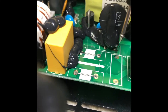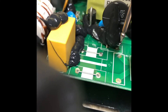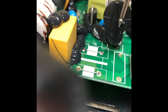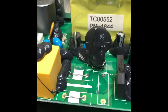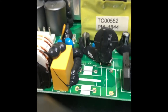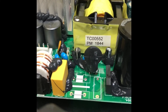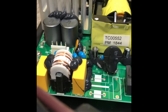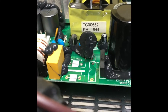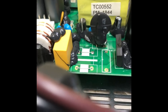It has two legs that go through it — one here and one here — and they're so skinny that the thing has room to bend and flop. You can see where I put a glob of solder to join the leg back together; it was fractured. So the amp would cut out after it had been on for a little bit — it would just suddenly stop. It took me forever to find this, but hopefully if anybody else has the same problem, you can go to that as one of the options quickly instead of trying to test through a bunch of chips. This thing had me bamboozled until I looked closer at the top of the circuit board and saw the fracture on that one leg of the capacitor.